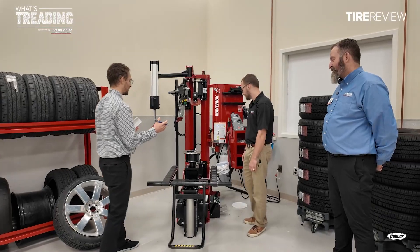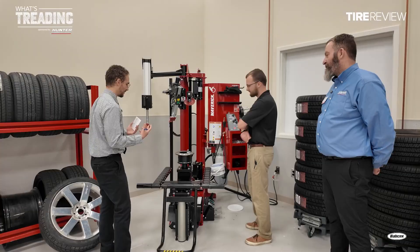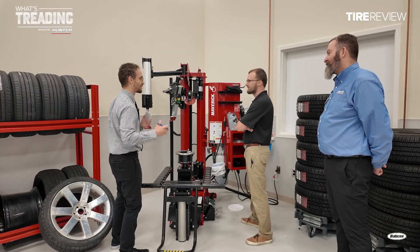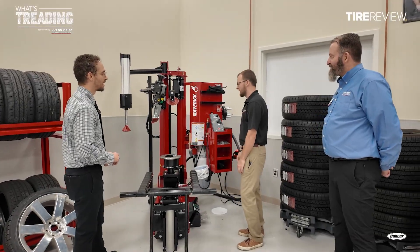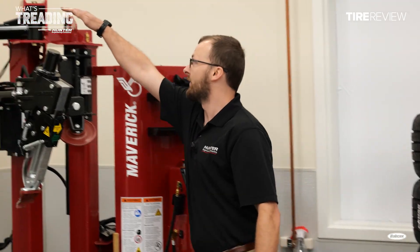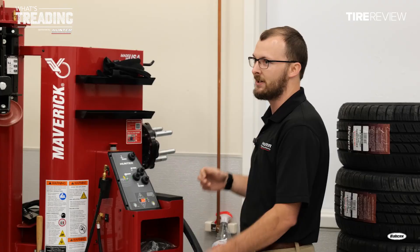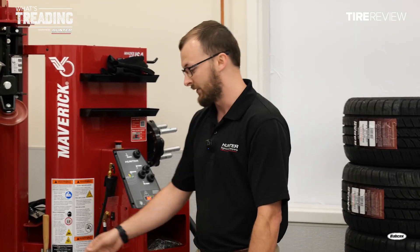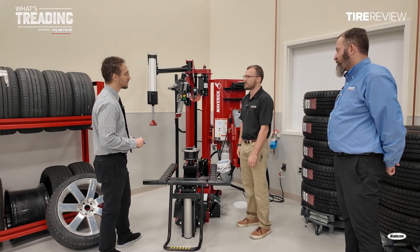The footprint of this machine — it's not the smallest, but it's not huge. You were able to add these different features. How do you make sure features are added in the right place without getting in the way of what's already working? Really, the overall footprint is defined by whether we can fit this thing in a demo truck. There's a welded-on bracket at the top of the machine — that's a hard limit. Depth matters too; things beyond the back of the machine limit how close you can get to a wall. But at the front of the machine we have a sliding spindle, so that's free space we can take advantage of. Really, we're taking advantage of area that's already being used.